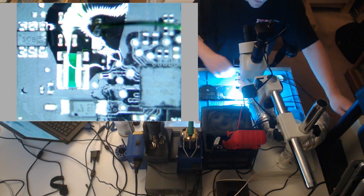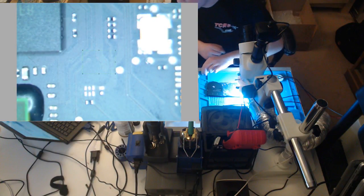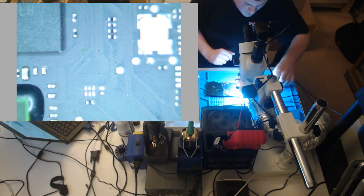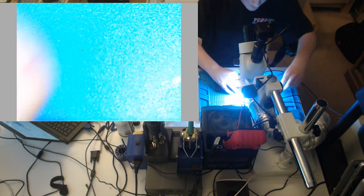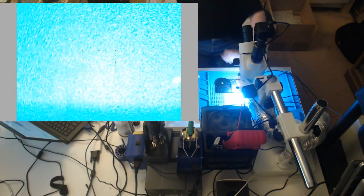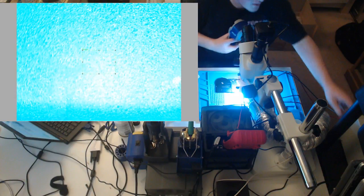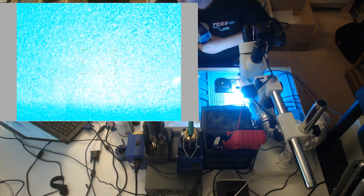Alright, so let's get our FLIR. Let's hope that our CPU is not dead. I really hope it's not. What I'm guessing is when the original ISL died, it probably took out Q7035 or Q70 or whatever it is, Q7031. I don't know off the top of my head. Our FLIR, let's start low. The board's still really hot, so.